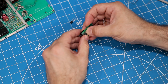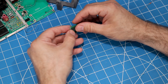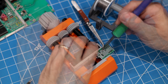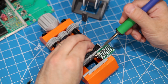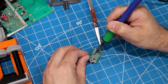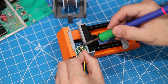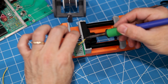I then mounted and soldered the 3.5mm audio jack to the end of the board opposite the pins. Next I inserted the 2N3904 transistor — the base and collector connect directly to pins 3 and 4 of the pin header, so I just bent the legs down and soldered them directly to those pins. I then soldered the emitter to one of the outputs on the 3.5mm jack, using a scrap pin pulled from the connector earlier as a conductor. Then I soldered in place the 2.2 kiloohm resistor — one leg goes to the base pin and the other to 5 volts. And then the 3.3 kiloohm resistor — one leg into base and the other to ground. The 3.5mm jack needs to be grounded, so I used a piece of wire to connect it to the ground pin. I love using silicone wire for this type of thing because it's just so easy to pinch off the insulator and work with.